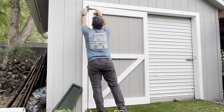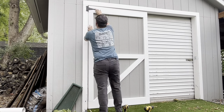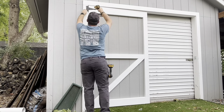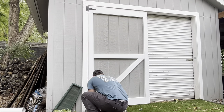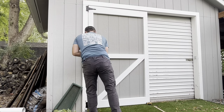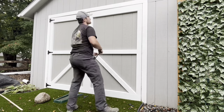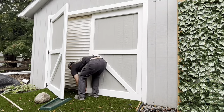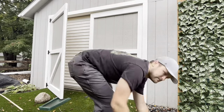Alright, let's get these doors mounted. This is fairly difficult — my opening isn't perfectly square, which makes it hard. You've got to shim the bottom so it doesn't touch and rub when closing, and shim the side of where the hinges are to get it as square in the opening as you can. You really just need to make sure it's not rubbing on the top and bottom when opening and not leaving an enormous gap. It did take some time to get these doors shimmed correctly and holding in place so I could get that top hinge in. I kept my old broken door in during this process because it was still semi-functional keeping the weather out — if I messed up a measurement I might have needed to trim the new doors down.